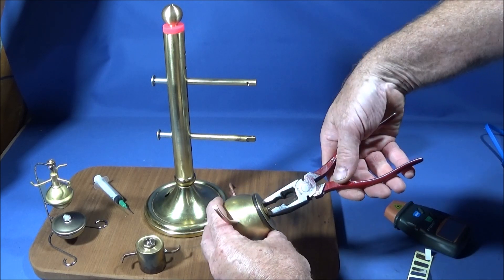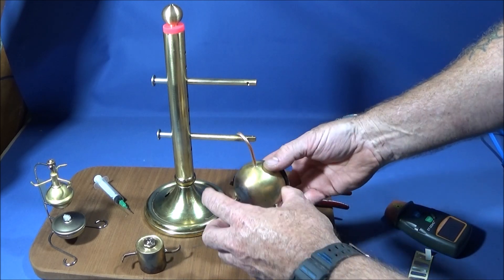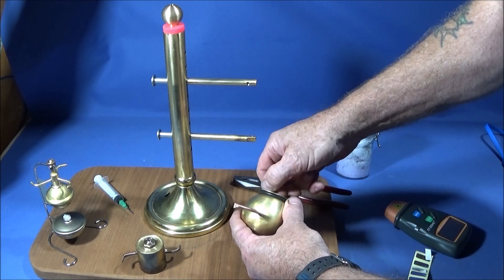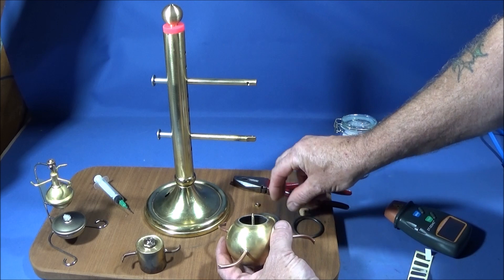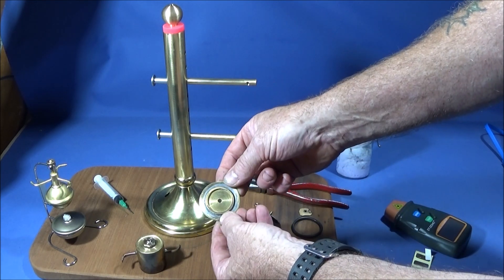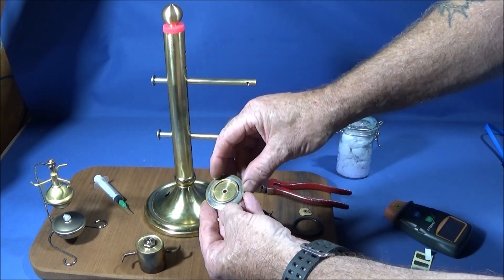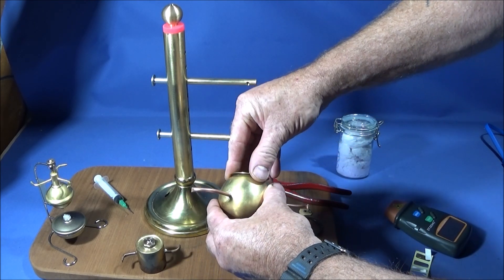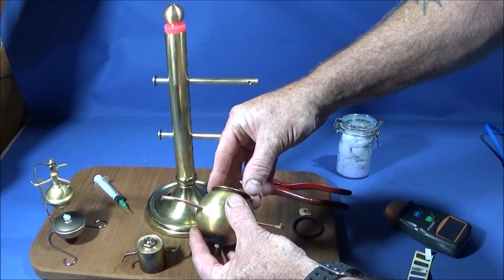It's a very simple design really — it's just a threaded rod that goes right the way through the ball. I've threaded this end here with a 4BA thread on the actual rod, and I had to make it as lightweight as possible. The rod comes through and then I made this disc out of about 0.9 mm of brass plate, turned a little rim there, and soldered that on. The solder lasts alright up on the top here because it doesn't get hot enough to actually melt, and I've put a rim of solder around it to produce a bit of a seal.